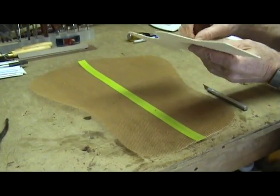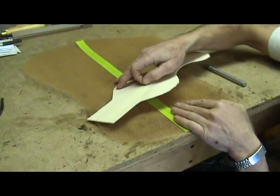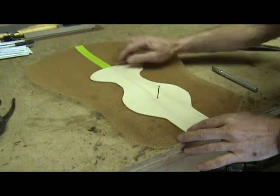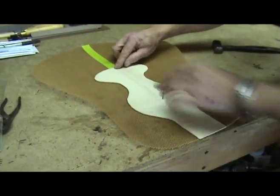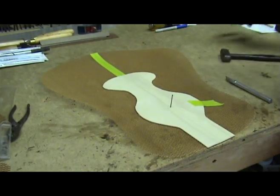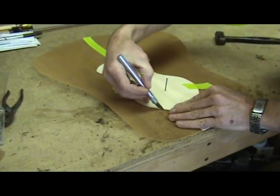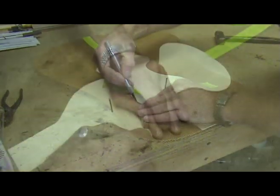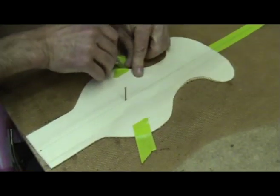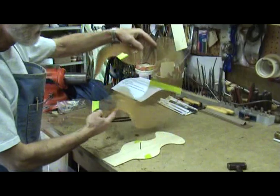Now we need to cut out the part of the Nomex where the solid part of the top will be. Use the finish nail to line up the solid piece on the Nomex. Now you know why Alan clearly marked the center of the sound hole on the Nomex. Also align the center line of the solid piece with the center line of the Nomex. Place tape on the solid piece to secure it in place. Now carefully use the razor knife or chisel again to cut out this part of the Nomex. Work slowly and carefully, skipping over the tape that is holding the solid piece. Just like before, cut this area after the rest of the cut has been made. This is the piece of Nomex that will be used in the double top construction.